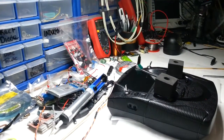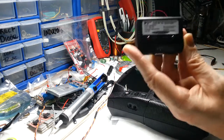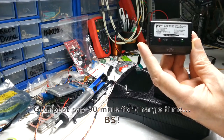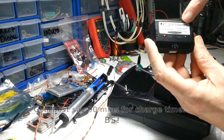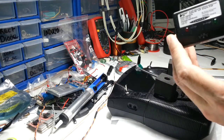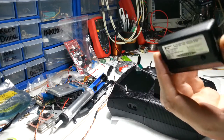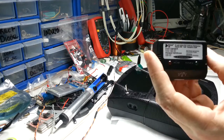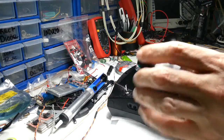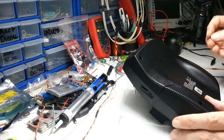Now, when you buy these and you get the 800 milliamp from Hubsan, here it is, and hopefully you're able to get focused in on that. It says 800 milliamp, 0.8 amp output, 12 volt. They advertise that on theirs. Now this never worked for me, because they gave me a 120 volt adapter to plug into this, when I should have had a 240 volt adapter, shouldn't I? That's where I live. And I didn't check it, because I just didn't think I'd have to, honestly.